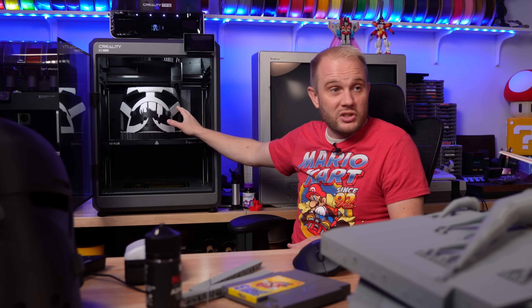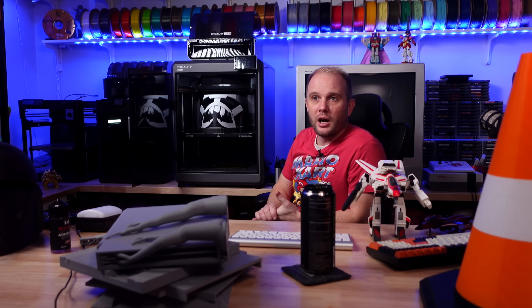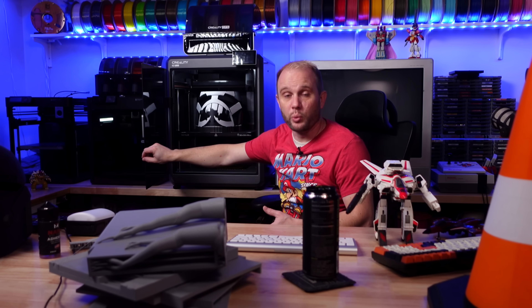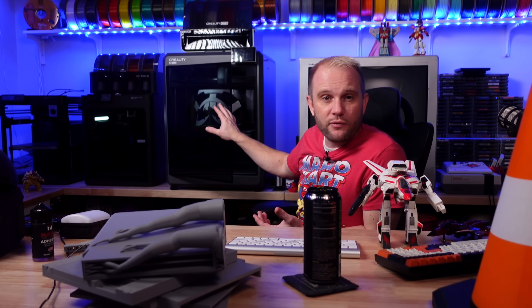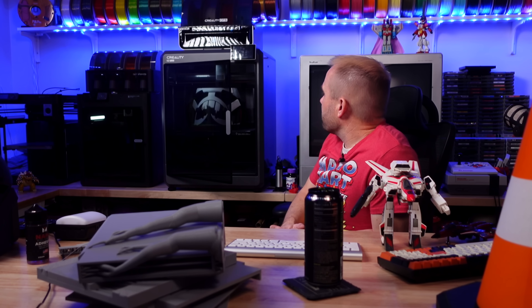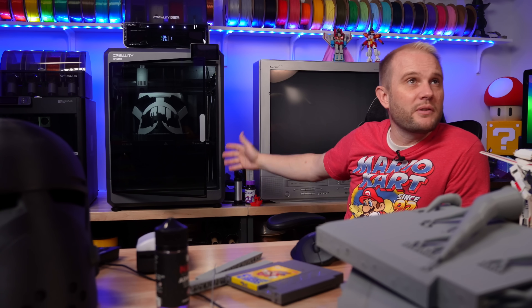I want to say that the K2 Plus so far is working out really well. Slicing experience, especially on a Mac — not good. Terrible slicing experience with Creality Print on a Mac. But print quality where the black is — the black is great, it looks really good. The white is rough like it's supposed to be because of how it was sliced; it doesn't purge enough with the default settings, because that's a galaxy black and the red and the white on this helmet has glitter in it, so the default purging in Creality Print isn't enough. But other than that, I really like it. This is probably my best experience with Creality — colors, huge print volume like 350 by 350 by 350. It's a really nice machine, kind of fun, except for the CFS that screams at me.